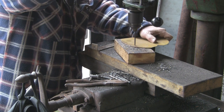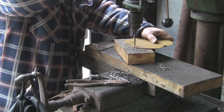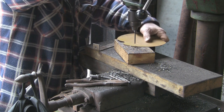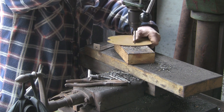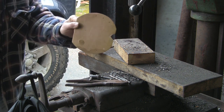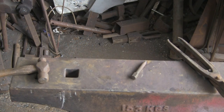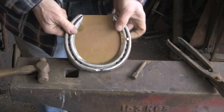You don't want to push too hard when you're drilling copper, because what tends to happen instead of it drilling is it sort of just burns its way through and leaves a great big burr at the back. You're still probably likely to get a bit of a burr anyway. A nice sharp drill — just go through really gently. There you go, six holes. Just over an eighth I suppose, maybe five thirty-seconds, which is plenty big enough.